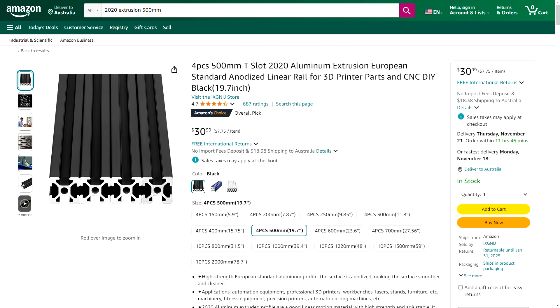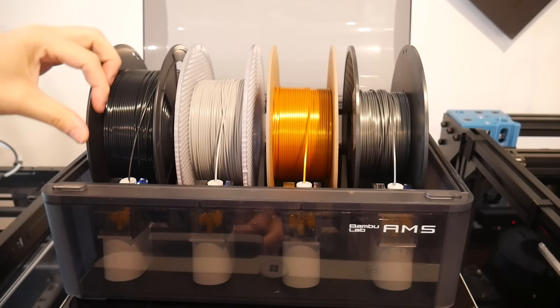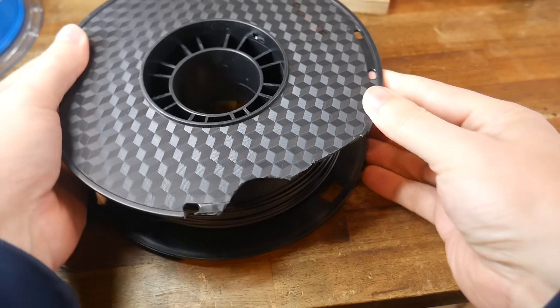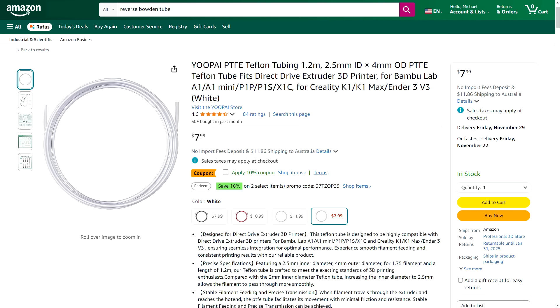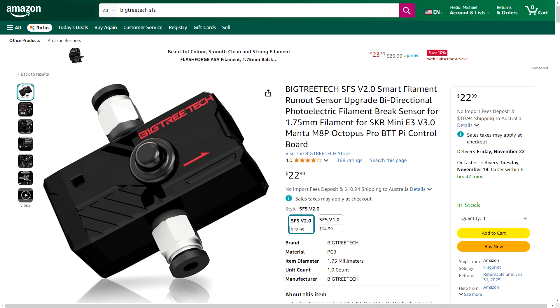Before I started designing, I needed to pick the hardware. I wanted some structure at the base of the spools, picking 20×20 extrusion because it's fairly affordable and versatile — one four-pack should be enough for the entire build. My plan was to support the spools from the underside on rollers, just like a Bambu Lab AMS — not great if you have smashed spools, but not really a problem for anyone else. A bunch of 608 ball bearings for the rollers, and some PTFE tube to guide the filament — not normal tube, but one with a much larger internal diameter for reduced friction.